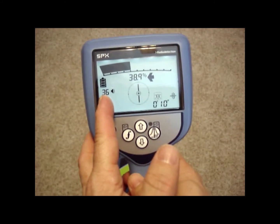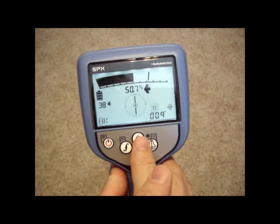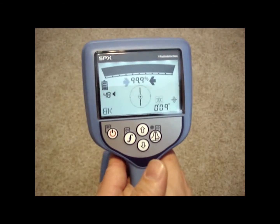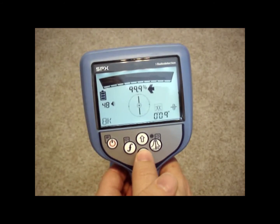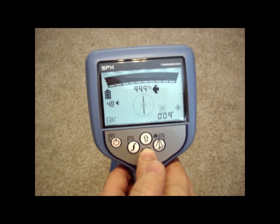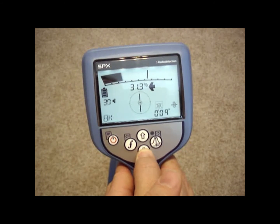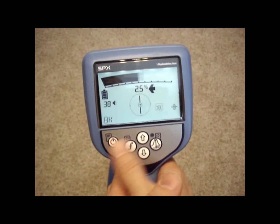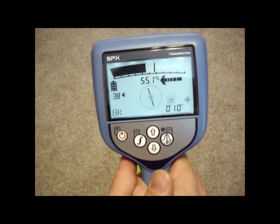Battery life is found over here, and your sensitivity level is found right underneath it. The sensitivity level will have to be adjusted up or down depending on how much signal you're picking up — the up-down arrows control that. If I'm picking up too much signal from the transmitter, I'll know it because I'll hit 99.9, which is as high as the scale goes. I don't want to hit 99.9 because then I won't be able to determine exactly where the peak response is. By pushing the down arrow it will automatically adjust and bring the number down to the 50-percentile range. The same is true if I was too low on signal — I can increase my sensitivity level by pushing the up arrow, and it automatically adjusts to the 50-percentile range, giving me a good response.